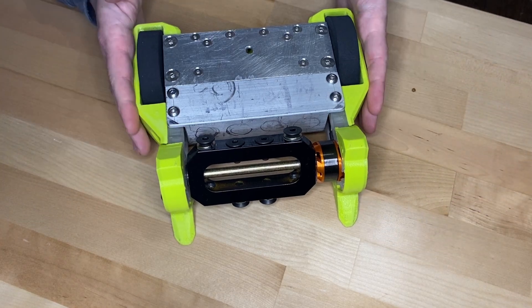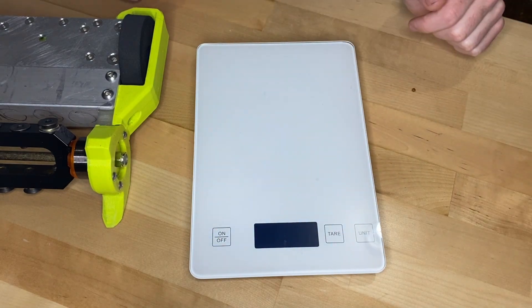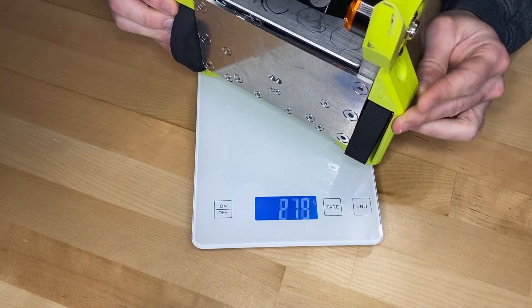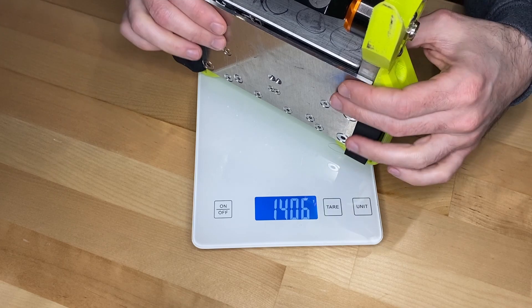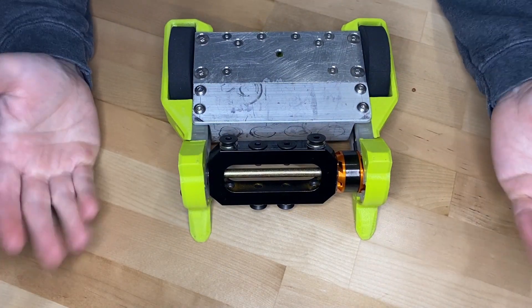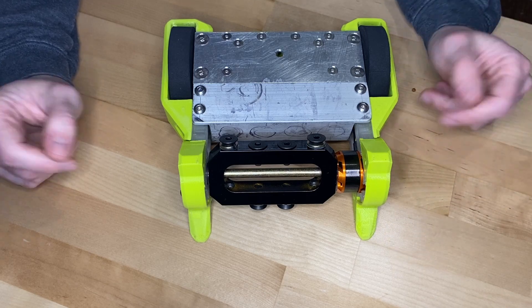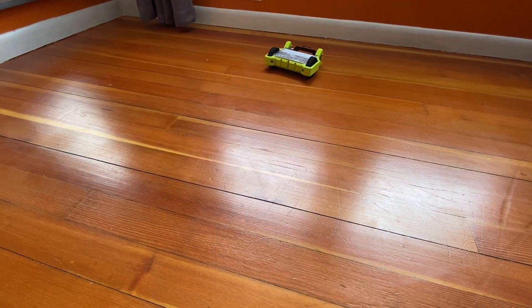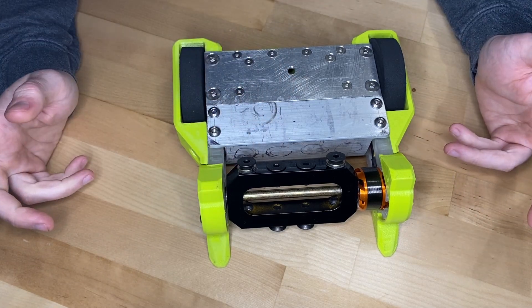And then we've got to talk about the weight. I know some people don't like to talk about weight, but we gotta. As you can see: 1406. We need to be at 1360. I did do some things that added weight I wasn't planning on, like increasing the thickness as well as adding extra screws to the weapon. It could be worse — 40 to 50 grams isn't the worst. I already had planned, as many people commented, to lighten out these plates of aluminum. My estimated savings for just this one piece out of three would be somewhere in the range of 20 to 30 grams.